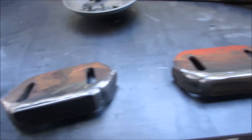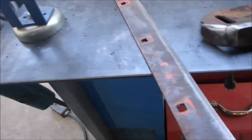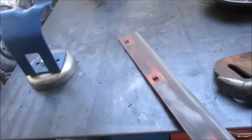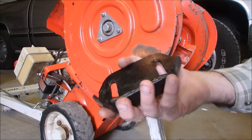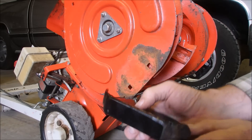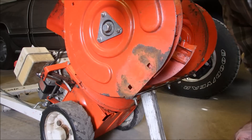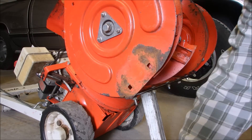I just hope they're not too thick now. And I cleaned up the scraper bar, put a dull edge on it — not a sharp edge — it was too sharp before. So we'll just stick a coat of black on these and then we'll be ready to stick them on the machine. Here's my new skid that I made — sorry, I repaired it. I welded a new quarter inch piece onto the bottom, and it's going to go on like that. I just sprayed it black because I didn't have orange. It turned out pretty nice.